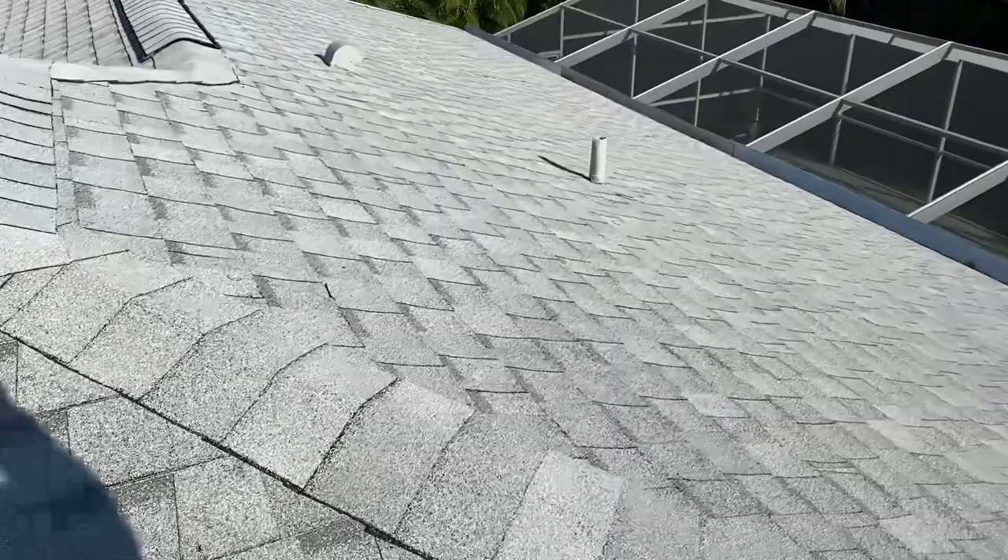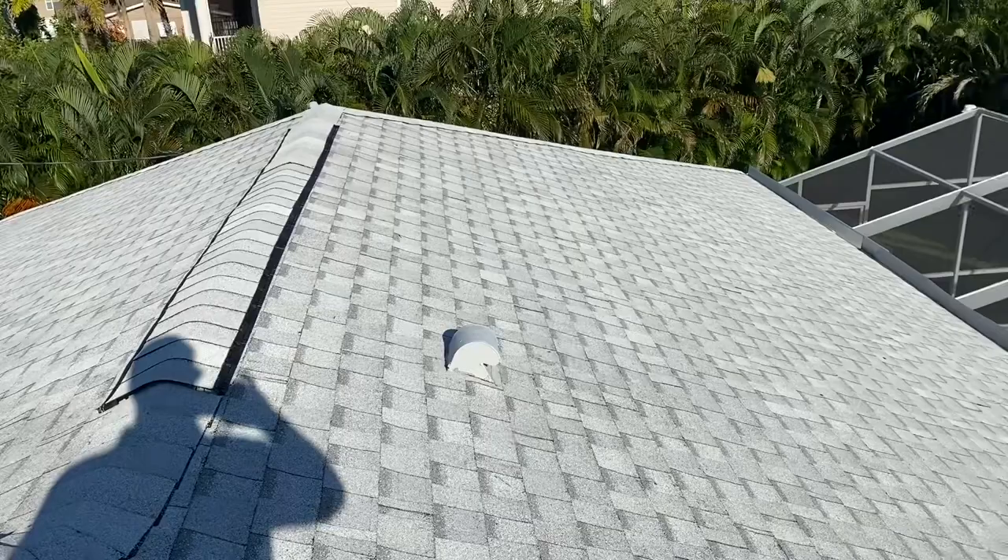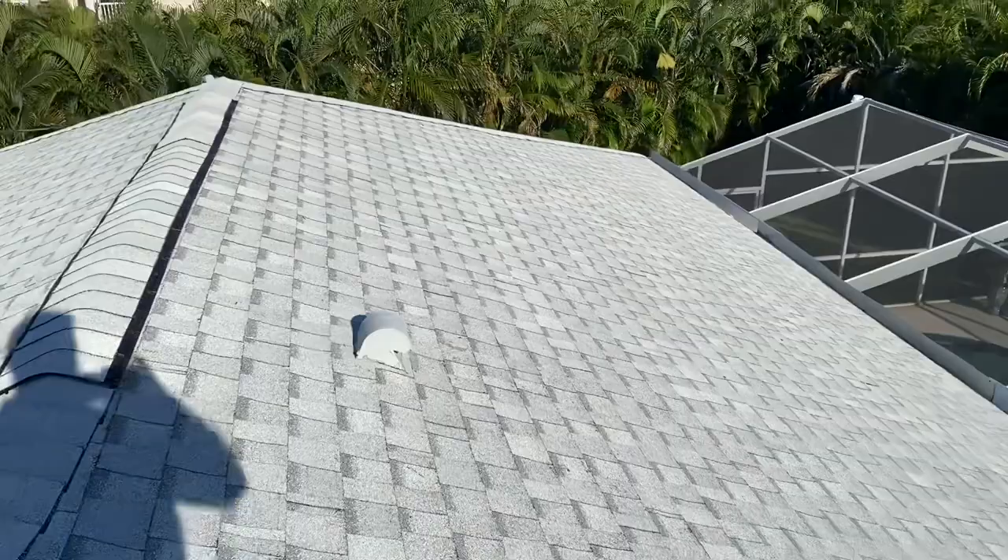And that's okay to do — you can take a tile roof and convert it to shingle. But you can't go from shingle to tile without special engineering involved. It takes a lot of engineering work; you've got to make sure the roof can support that kind of weight. It is 100% okay to go from a tile roof to a shingle.